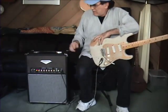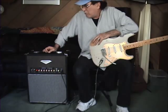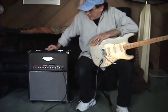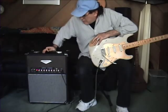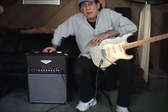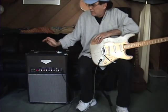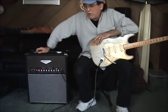Wonderful amplifier — 20 watts. If you're ambitious, with the power transformer in there you could probably put 5881s and bias it a little bit differently. It sounds great with the 6V6s. It is a little Dumble-style amp in a small combo that you can take and just sound like a mofo when you play. It started off as a Seriatone OTS Mini 20, but we hot-rodded it.